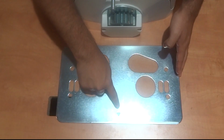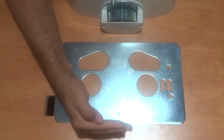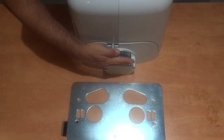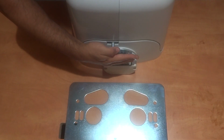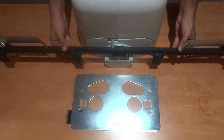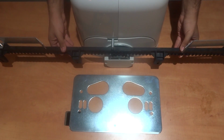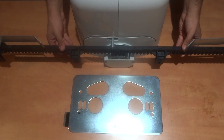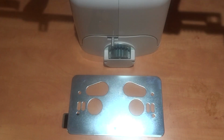The arrow on the motor baseplate should be facing your gate from the inside of your residency or gate held area. There should be a minimum of 50 millimeters, 5 centimeters, or 2 inches of space between the edge of the motor to the sliding gate. As well, there should be a 2 millimeter gap between the teeth of the motor gear and gear rack. By hovering slightly above, some pressure and extra weight is alleviated off the motor, allowing it to run more smoothly.